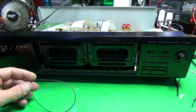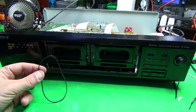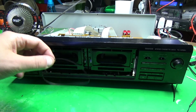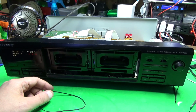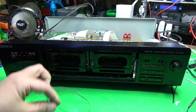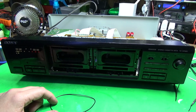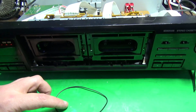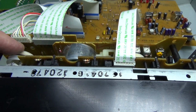The belts were slipping. So, if you remember, or if you saw the video, I boiled the belts. There's more of them than just this. This is just one of them. But as you can see, I pulled it off the shelf to do this test, and it didn't play at all. Took it apart, and the belts are slipping, and you can see the shape that the belt's in. Now, I tried reboiling this one. It didn't do anything. So it does work, but it's just a temporary solution. So like I said, put new belts in it today, and it's got all new belts.